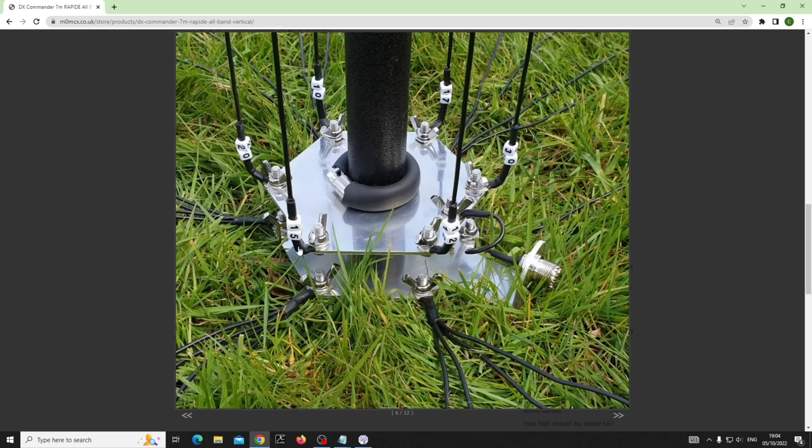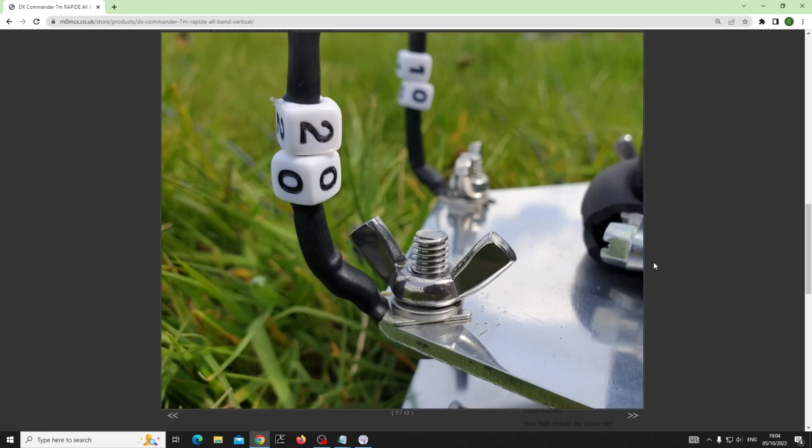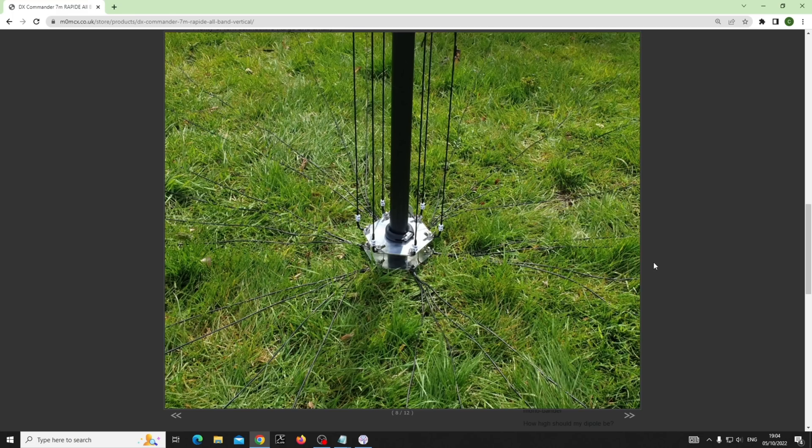So that's how a DX Commander works. It's just a cut chart - you get a kit, a tape measure, for example the 20 meter band element is five meters and two centimeters. You put a ferrule connector on, you get some heat shrink and a few other odds and ends, and away you go. Nice and simple. I've got some radials on the ground and this is just a working antenna. I couldn't possibly know another antenna that is that simple with no components - no traps, no loading coils, nothing - just a bit of wire. So have faith, it works really well. Thanks for tuning in and I'll see you on the next one, bye for now.